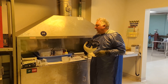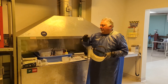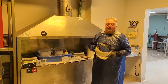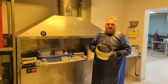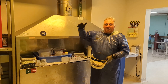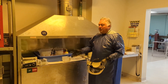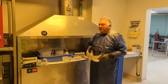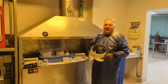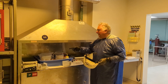Always use fresh buffered HF. There was a gallon bottle in there with only a little bit left, and I'm not going to use that for this — I might use it for general cleaning. Because as a graduate student, I had been using that same bottle all semester long, and I noticed things like photoresist lifting off and ruining all the experiments. I had no idea what was happening. Then it all went away when I used a fresh bottle. So, words to the wise: it's better to verify that your BOE is fresh.